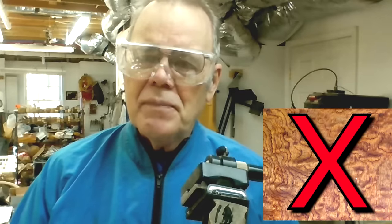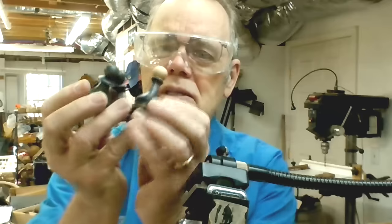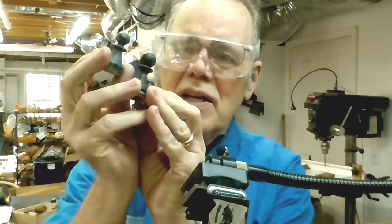Let's talk about wood. For the light pieces, you want a light wood with a tight grain. You don't want anything too exotic that would camouflage the design. When it comes to the darker pieces, you can either use dark wood — walnut will certainly work — but on my pieces, I tend to dye them with a black dye, or in one case even a green dye.